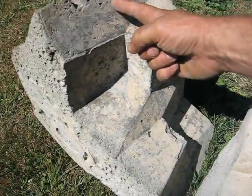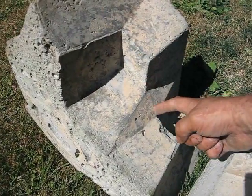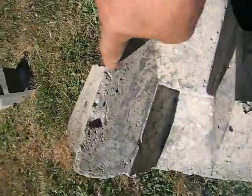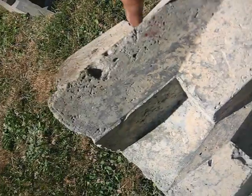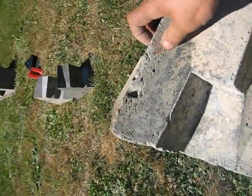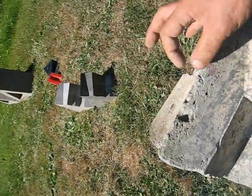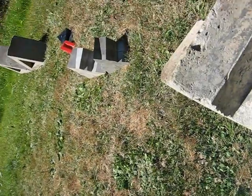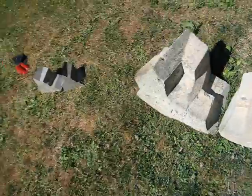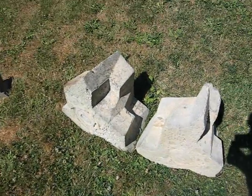Also, halfway through the block face where this second inverse mirror plane is, this creates a line of sight looking straight down the block edge — you can kind of see right here. What that means is you can weave in a tensile element like a rope or a steel cable to weave these blocks together as it's assembled. So that's some of the evolution of the idea, and it continues — that's the good news.